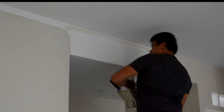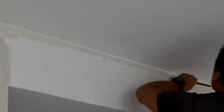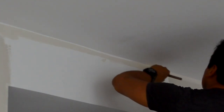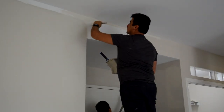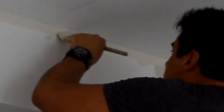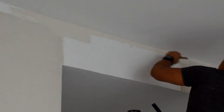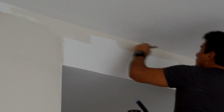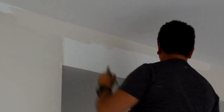Here's my technique to do the edges against all surfaces. I go ahead and apply paint in close proximity, leaving about a half-inch space. Now that I know I have paint on the surface, I can control the brush easier — I can do long stretches of straight lines instead of going back and forth. After that, once you see how much paint you have on the surface, you want to fill it up a little bit more. Don't worry about the brush marks because we're going to use a small four-inch roller to take care of those.